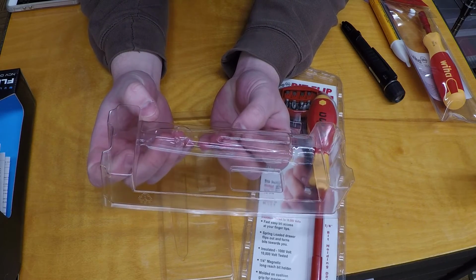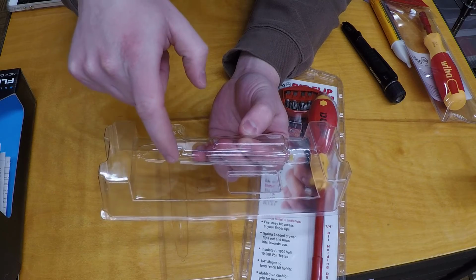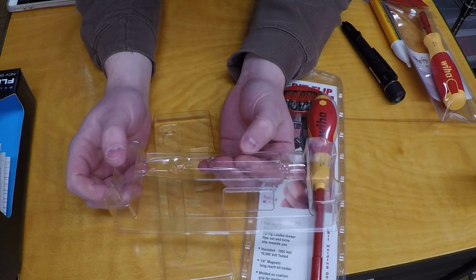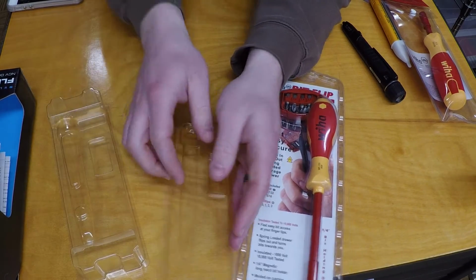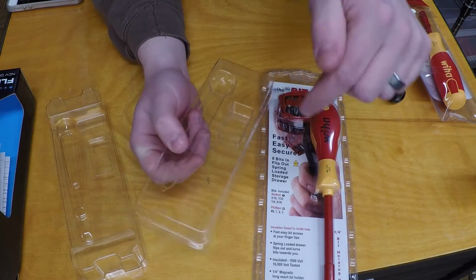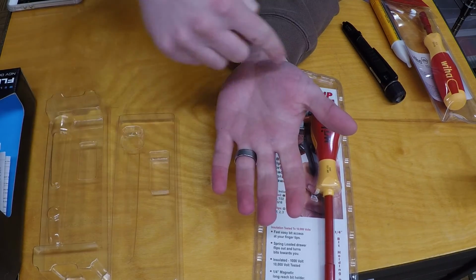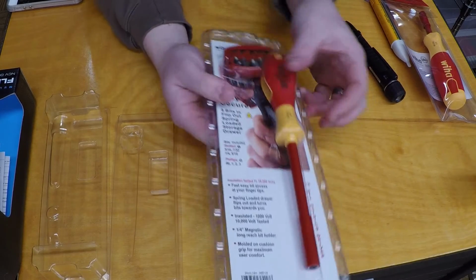I'm looking closely. The other thing you can see sometimes in thermoform molds, sorry, that's a boiler coming on, is you'll see little nipples or pinpoints around deep cavities around edges, and that's holes they drill in the mold to help vacuum get to the plastic. You can't see a whole lot on this mold. It's not that interesting. This side, not that interesting either. A great place to see the pinholes actually is on the top of your Dunkin' Donuts cup of coffee in the morning. The lid, you look around that sort of dish in the lid and you can see all the pinpoints from the thermoform mold.